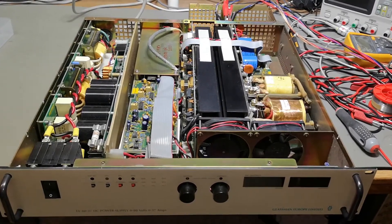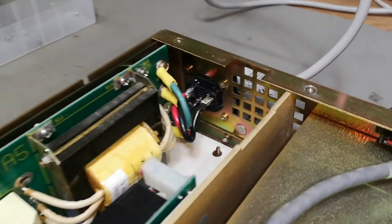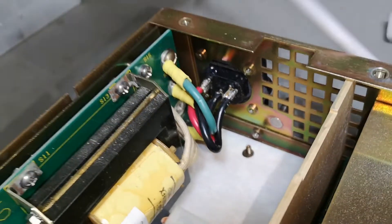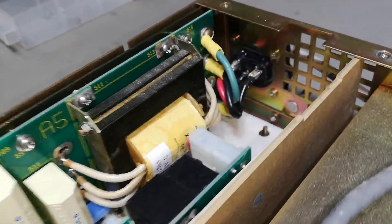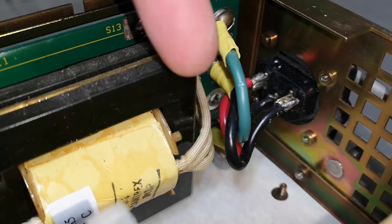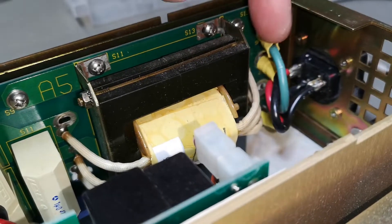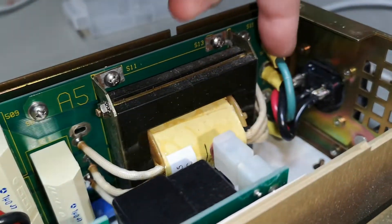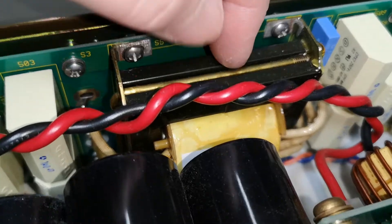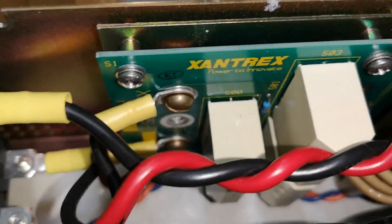Let's look a little bit inside this fantastic power supply. Here is my single-phase modification — there's an extra screw down there for three-phase input. The first connection is of course ground/chassis/earth. The other three are the three phases: three-phase filter, three capacitors, another three-phase filter, three more capacitors.